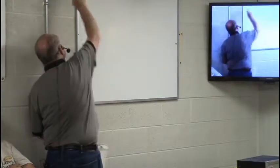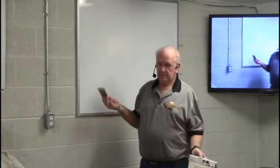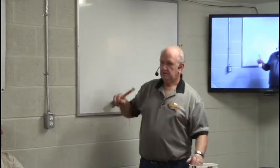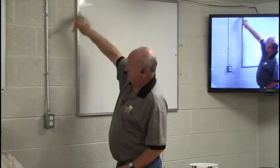I can take that and run it down there, and when I come back for the second coat, I'm going to get it. I told my oldest boy who does all the trim for me: just think of it this way — put an ounce and a half on now and the other ounce and a half on later, not all three at once. Because what you'll do is you'll get gumming. If you put a glob on here and another glob and don't brush it out, you've got too much paint. So loading the roller properly is an important thing — that's the key to it.